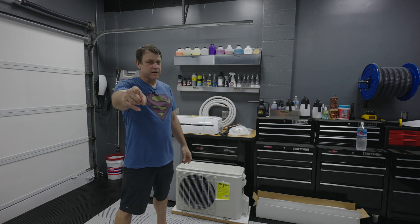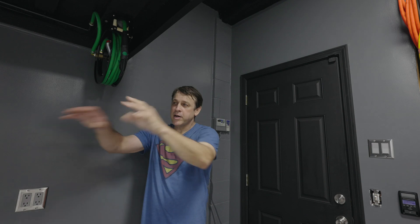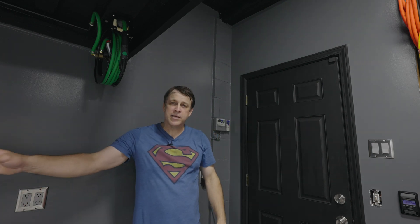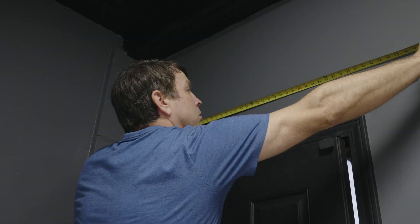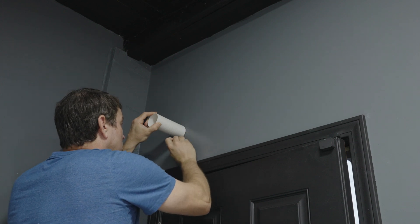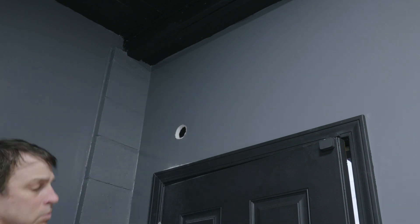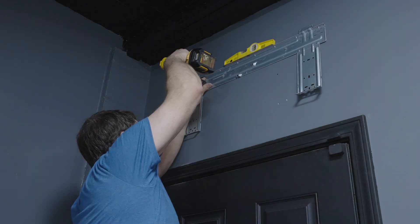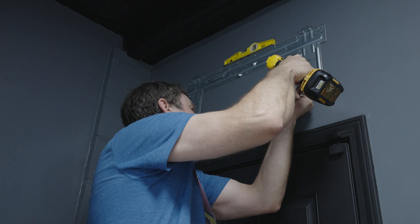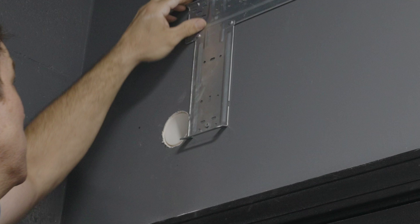Let's get it on the wall and get it cooled down. Here's where I plan on installing the indoor unit — it's going to fit perfectly right above the door, blow air into the garage effectively, and be out of the way. The next thing is to figure out the exact location, drill our holes, and get it hung up there. When figuring out our mounting location, we want to make sure we have studs to screw the mounting bracket to, and a clear path through the drywall for the hole for our control line, line set, and drain. When mounting the bracket, make sure to get adequate screws into the studs so it's securely mounted.